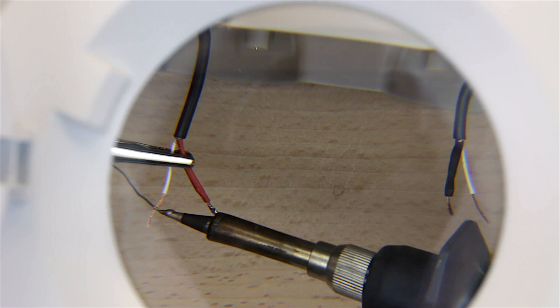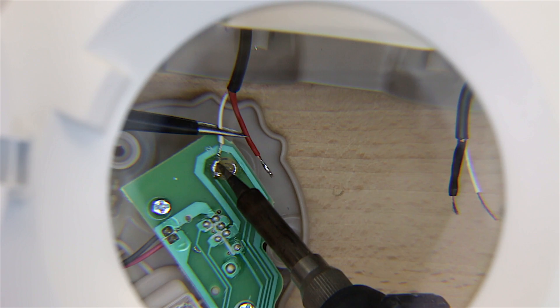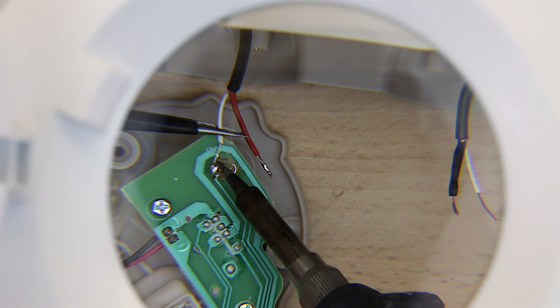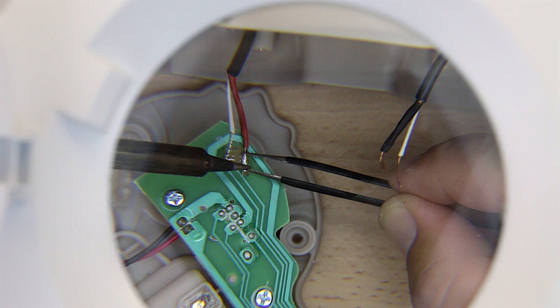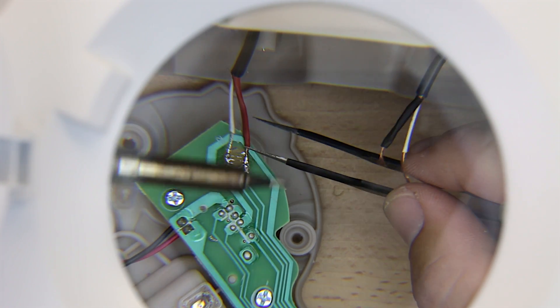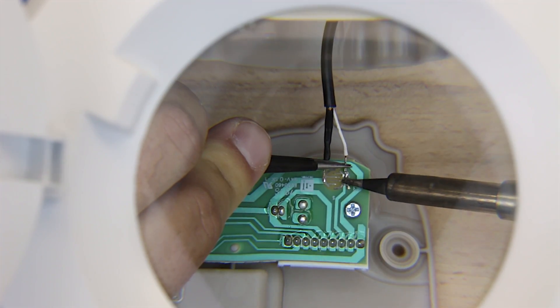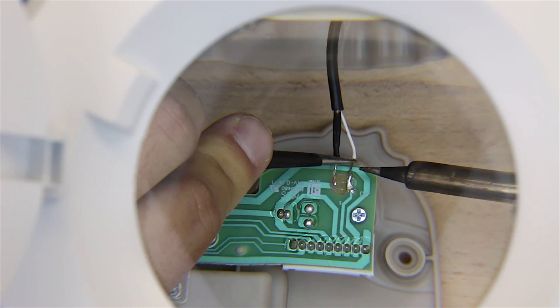The first thing we do is apply a little solder to each wire — that's the solder we're going to heat up to stick to the circuit board. This makes it a lot easier: instead of trying to get a little bit of solder on the board, we just heat up what's on the wire and stick that to the board. Again, make sure that no solder or wires cross over to the other half of the disc or the toy will constantly go off. We'll repeat this process for the other disc — apply a little solder to each wire, then use that solder to apply to the disc.